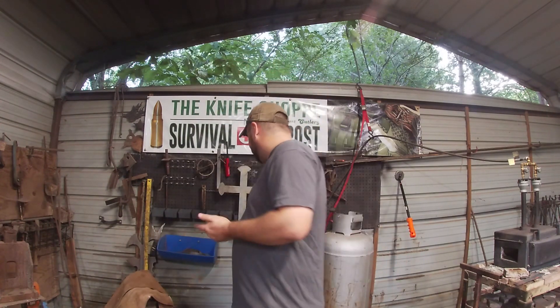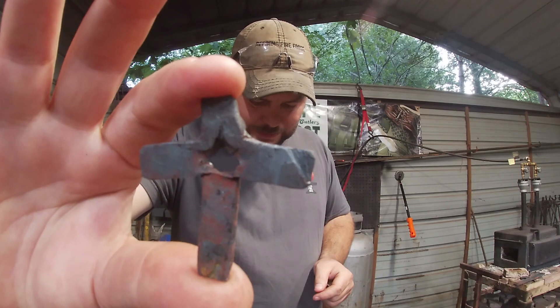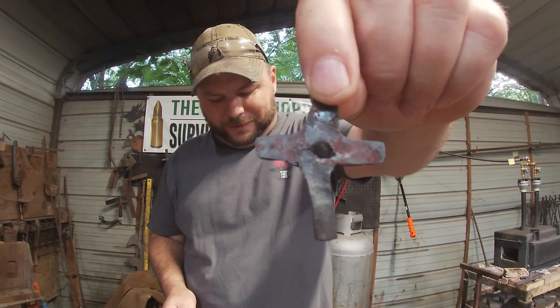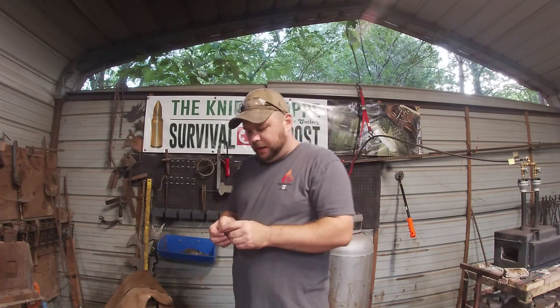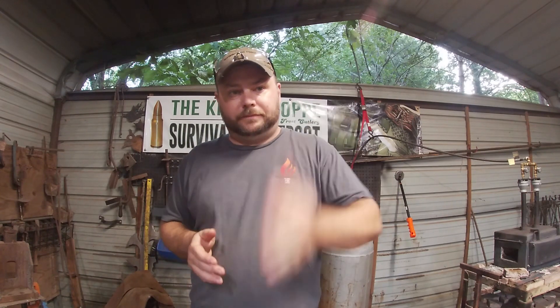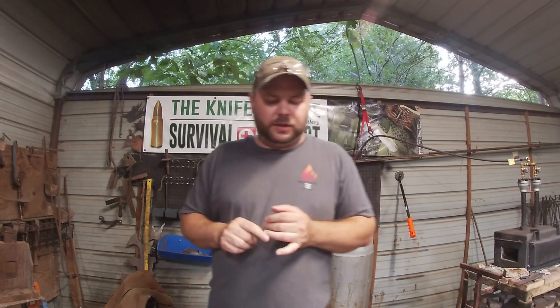You will have mess-ups, guys. Let me show you a couple of my fails. There's that one — it just didn't turn out right. And then there's this one that I tried my best to save, and I probably can finagle it and do some stuff to make it work. I wasn't using a saw to cut it — I actually used an angle grinder because I didn't have the saw at the time and I was trying to get a bunch made fast. You can use a hacksaw to cut this out, it just takes a lot longer. 3/8 material makes really good cross necklace material, because even if it's a little big, you can cut it down and it stays small enough to make a really nice necklace.